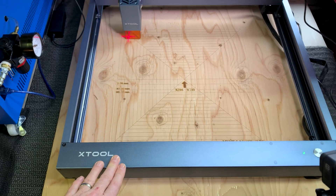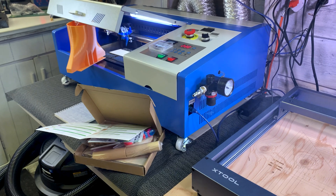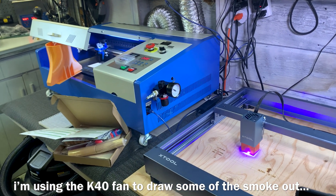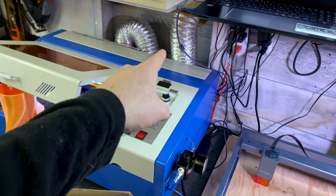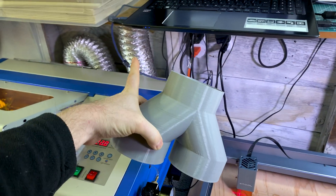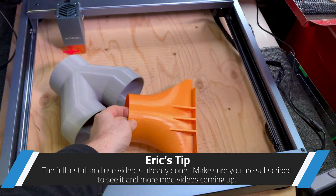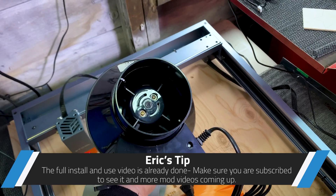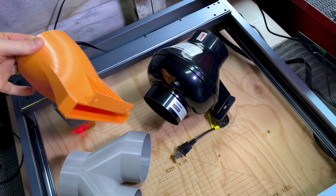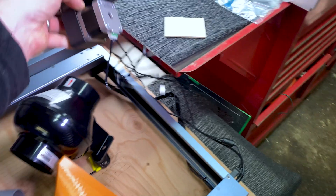This is now a mark of the workable area — a little bit more than shown because the author left a buffer, but it's quite a bit smaller than the actual frame; you have to make do with the space for the gantry. During this cut it filled the room with smoke. I tried to capture it on video, but for a tiny engrave it kicked out a pile of smoke. I don't understand why people run these without ventilation indoors — that's crazy. I've already planned for this: some duct work materials and a heavy-duty duct fan to evacuate fumes.